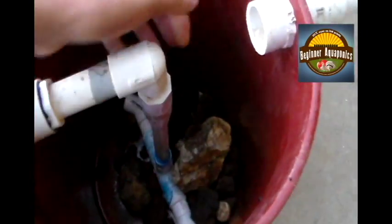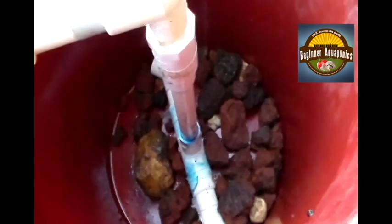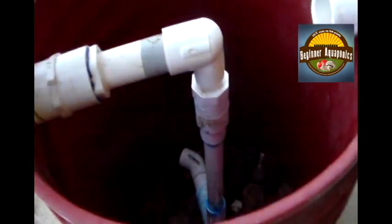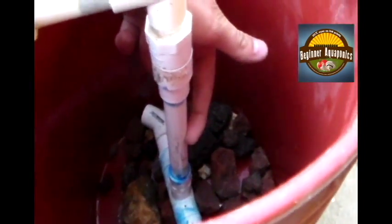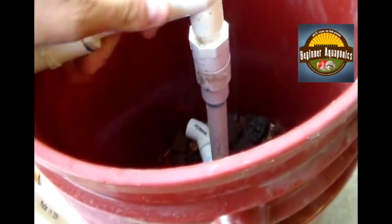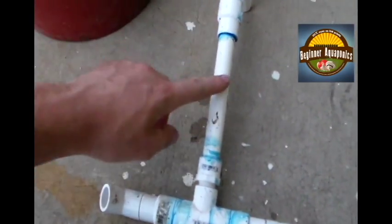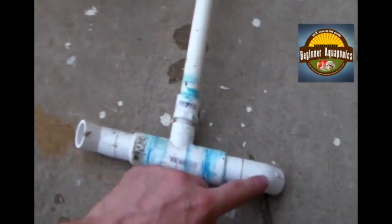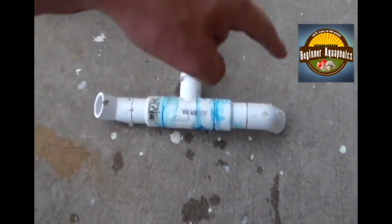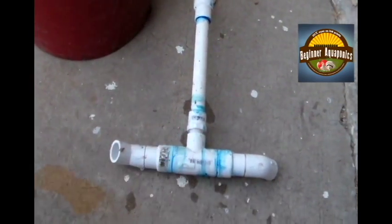On the inside, I've got some rock. Normally the whole bottom is filled up with rock. From there I go from one-inch to half-inch down to quarter-inch. Let me pull this out so you can see better. I go from the quarter-inch and then over to the quarter-inch 45s, with the 45s pointed in opposite directions. What this does is cause the water to turn in a single direction, which pulls all your stuff and keeps your large sediments at the bottom.